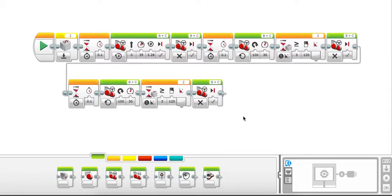So now let's say I'm going to presume that the angle the robot has created is 124, but we wanted 120. So now we're going to tell the robot, okay, let's move back in the opposite direction, minus 100. You don't want to go at the speed of 30. You want to go very slow. You may even use 3, you may use 5. I like 3 to 5 is fine. So you could use either. 3 is good. So now after it has moved to the right 125, you want it to move to the left till what happens? Till the angle is equal to 120 degrees. Now because it's moving so slow, it's not going to miss 120. So usually it will stop at 120, and of course after that you stop it.